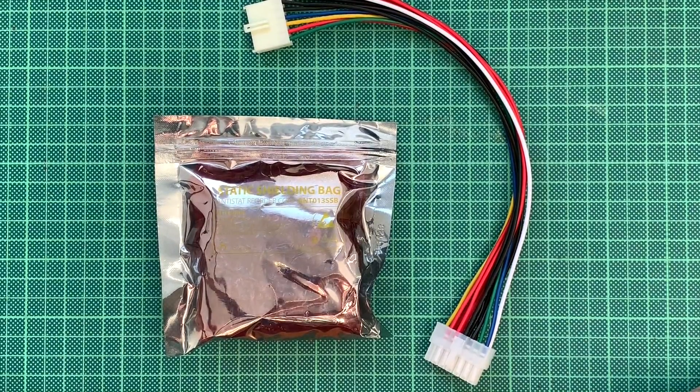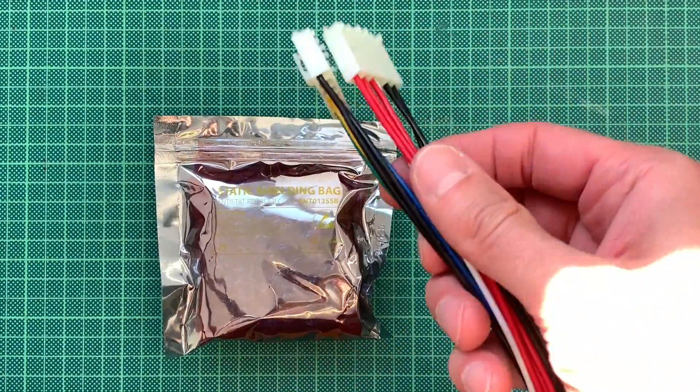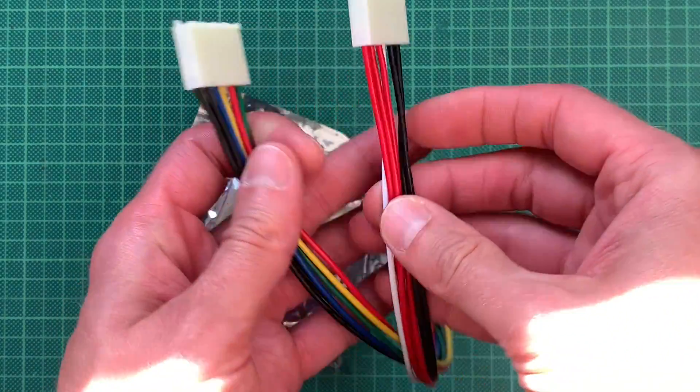It was a successful Kickstarter and it is a very useful one indeed. It is the ATX-2AT project, which lets you use a modern ATX-style power supply on an old AT-style mainboard like a 286, 386, or 486 — and maybe with some adapter even on an XT. But as it says, ATX-2AT is actually for 286 and up, because with the AT, IBM standardized on these connectors here.